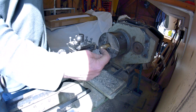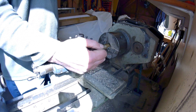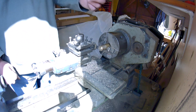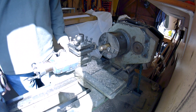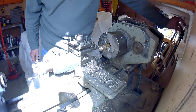Having turned this down so it's an interference fit by three hundredths of a millimetre, I'm just going to part this off and then cut a second one, then we'll do the other faces to get it to a good thickness to allow for washers and bits.